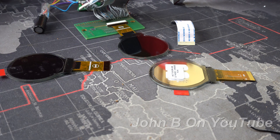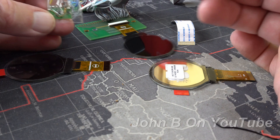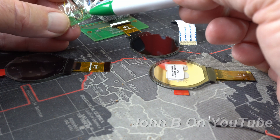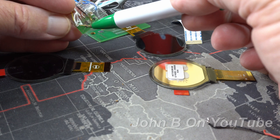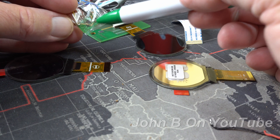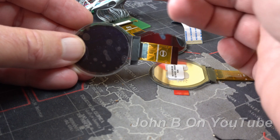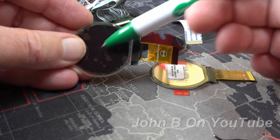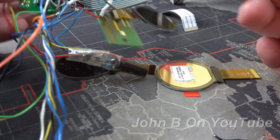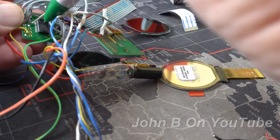They are 3 volt logic, but they need — which is why I've got the circuit board out to show you — a little charge pump or booster. This tiny little device, insulated with sellotape, is a Maxim charge pump. It uses one tiny coil buried here somewhere, and a tiny 0805 10 microhenry coil with coupled capacitors that steps the voltage up from 3 to 15 volts. These are organic LEDs, so there's no backlight — you need the higher voltage for the drivers. I've also got a real-time clock calendar on here, and I'm using the PIC18F27K42 because it's got a ton of RAM and ROM.